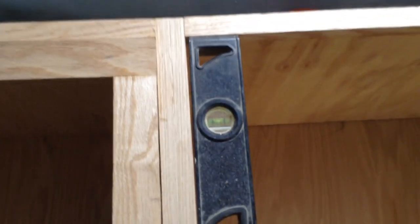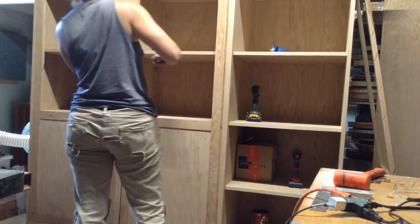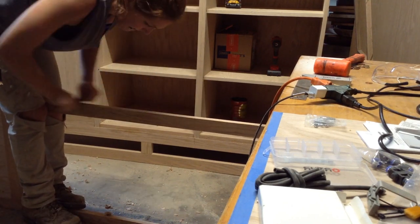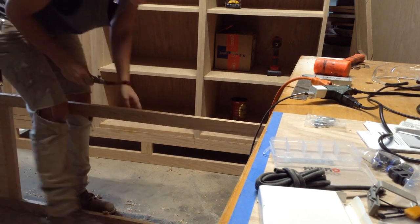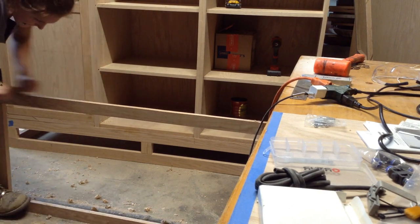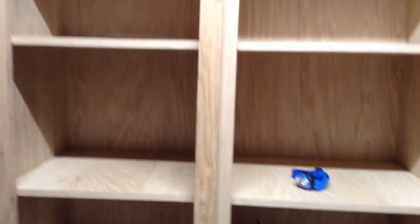If these were fixed shelves it usually helps alleviate some of that issue. I have one edge fitted and I'm going to mark where the spots are where the material needs to be taken down. I'm not going to worry about reveals at this point — I'm just going to get it to the point where the door fits inside the frame. This was a long process: I had it fit in there, I would take off high spots, get it so it fit in the frame, but you can see it's still kind of sticking out at this point.